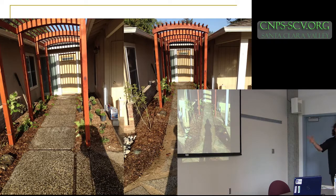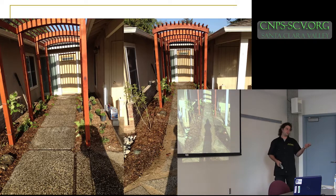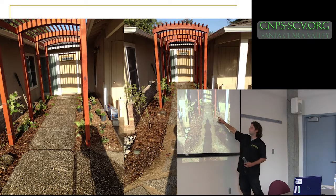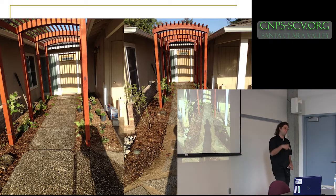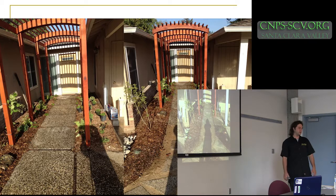So cutting out the areas could also be a solution when there's tree root damage on existing hardscape. Yeah, totally. And just like we're talking about, you don't know what's under the concrete until you start cutting. So we started cutting this, and there was a whole other concrete patio below it. It was this thick of concrete. So there's no way to know until you start cutting.